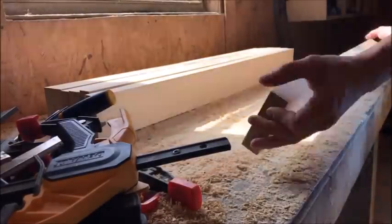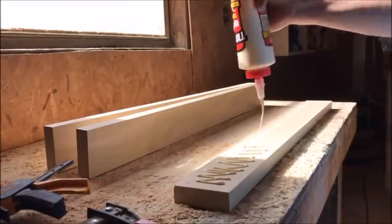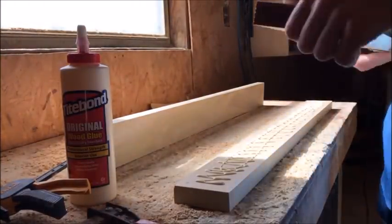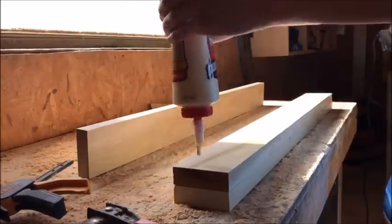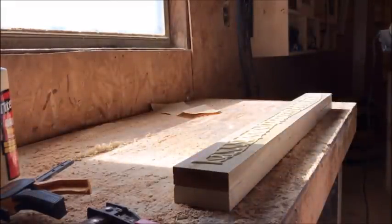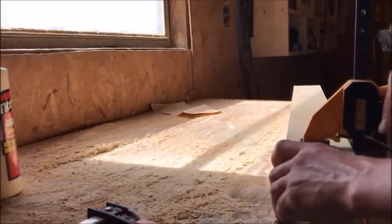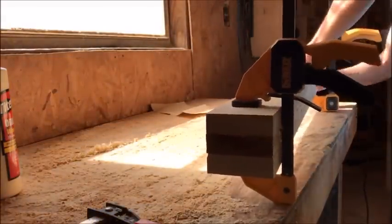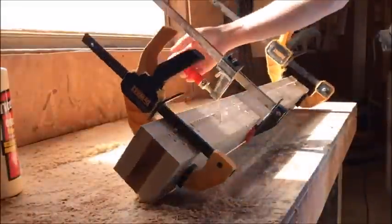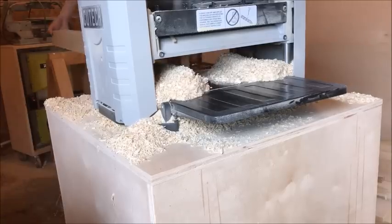I made my bed and my nightstands out of rough sawn poplar, so the first thing I had to do was mill down all of my lumber to the same thickness and to the approximate size I was going to use. Because the bed posts were thicker than 1x material, which was the only thing available at my hardwood store, I had to laminate the boards together just like this — I just glued and clamped them. I've got more details on that in the blog post in the description below, but my posts ended up being slightly less than 3 inches by 3 inches. You can use a 4x4 for these posts, but your measurements will be a little bit different than mine. Once the bed posts were all glued together, I ran them through the planer on the laminated sides to get some nice smooth edges.